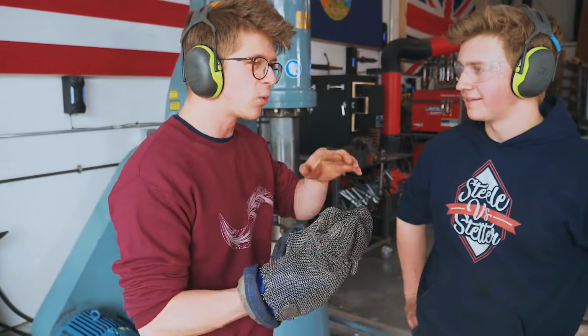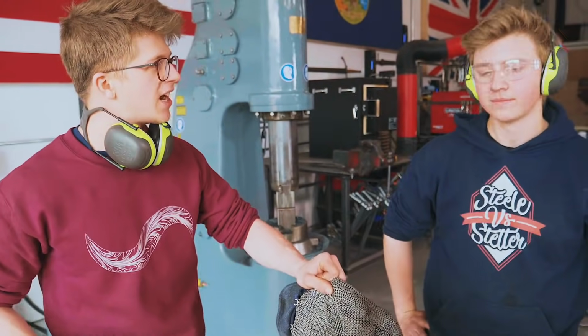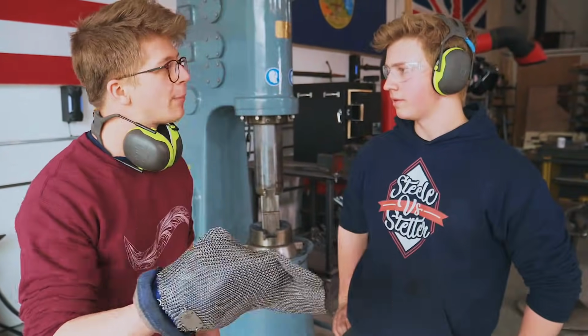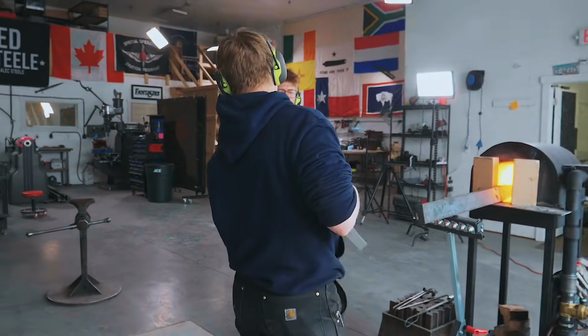It's tricky, because what we have is an extremely front-heavy piece of steel. You gotta keep lifting that bar up, doing little bits at a time. Heavy stock removal calls for feeding in; establishing the taper and getting an idea of your dimension calls for feeding out. Woo!